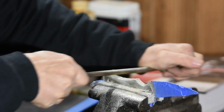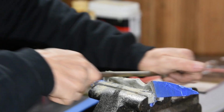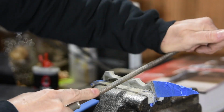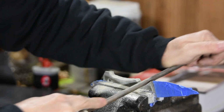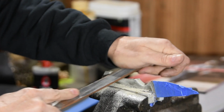One thing to bear in mind is that the blade's going to be very hard, so keep your file away from that. The tang is fine. You can file right on down into the tang if you want to take it that far. But if you try doing that on the blade, you'll wreck your file. You want to do all that work with sandpaper.